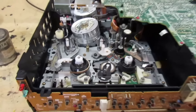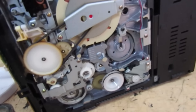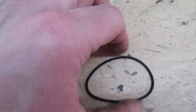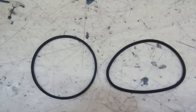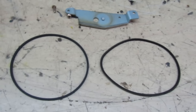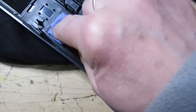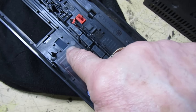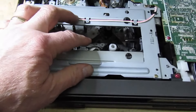Let's give it a spin - it sounds like the bearing's gone in it as well. So that's probably what the fault is. Where are we going to get one from? When you got it in the service kit it actually came with this aluminium arm. And look - the take-up idler has also disintegrated. All of these bits are what used to come in the kit years ago. That's completely gone as well. As a minimum we're going to need a new idler and a new pinch roller.